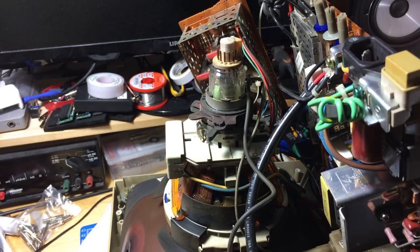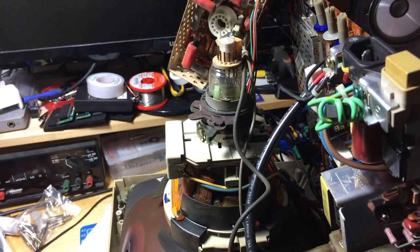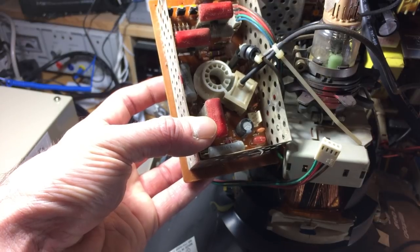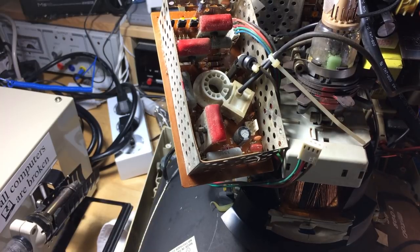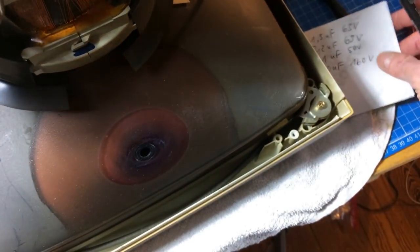There's a little pin that's a bit bent — I'll try to bend it back, hope I didn't damage it too much. You have to be very careful with this part of the tube because it's pretty brittle — it's a glass tube and you can easily break it. There's a lot of dust in there. There's also a 4.7µF capacitor at 200V which I don't have in stock, so I'll add it to the list of capacitors I need to get.